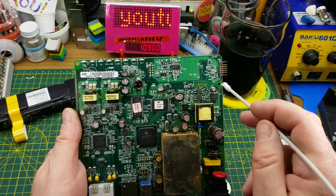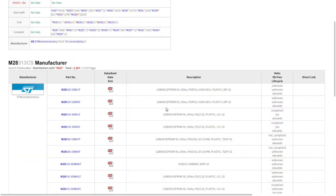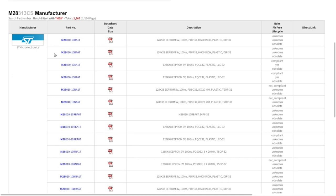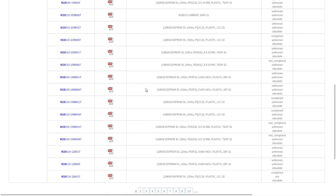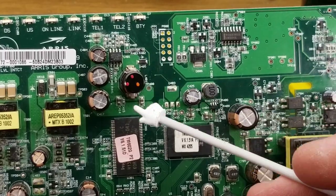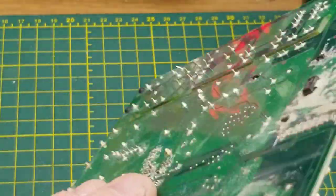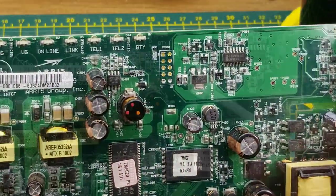What is this little chip down here? M28313CS. Can't find an exact match for it, but most things with the same root look like 128K EEPROM, so I'm going to say that's probably what it is. Though if it's an EEPROM, it's a little bit far away from the main processing. The other microcontroller is way over there, so I'm guessing it probably belongs to one of the big chips in this area.